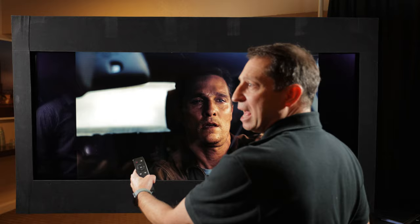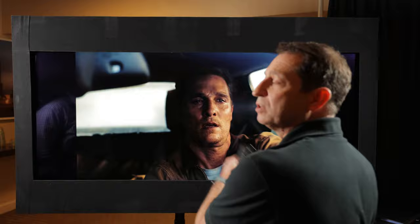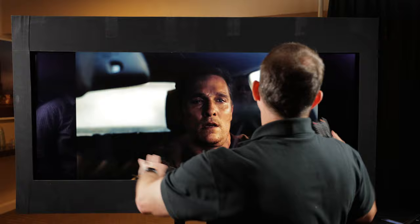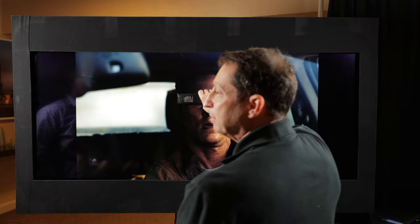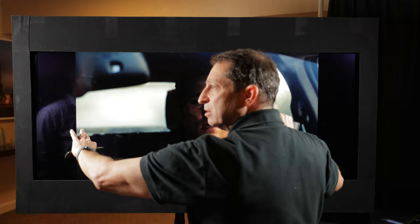This is 16x9 aspect content on the screen right now. Nonlinear stretch provides a way to fill the black bar areas in. A lot of end users say, 'Hey, why do I have these bars? I've got this big expensive screen — I want to fill the whole thing.' What's really special about our nonlinear stretch is that it's the only one that combines both vertical compression and horizontal expansion. Think about the screen like a sponge — if you compress it vertically, the sides expand. We get natural horizontal expansion from compression, and then add a little extra horizontal expansion to finish it off.